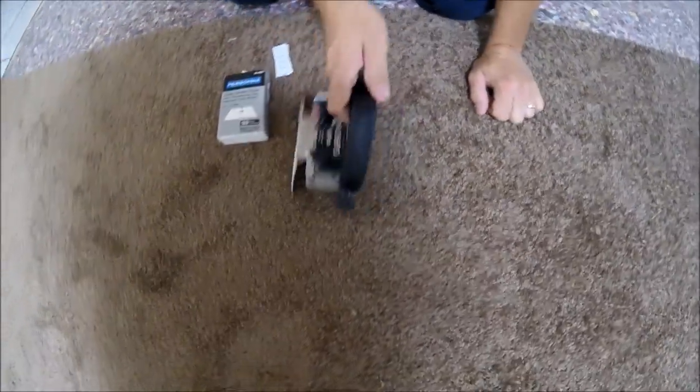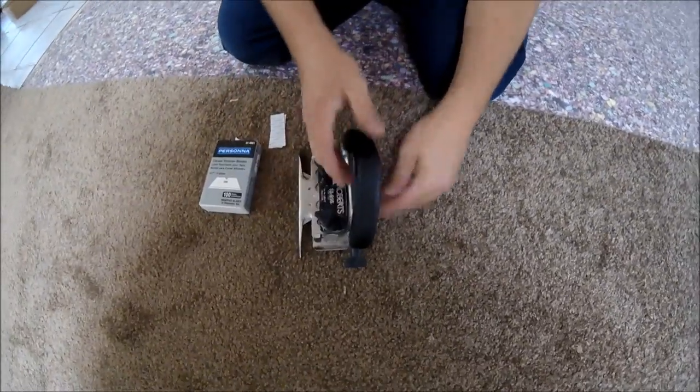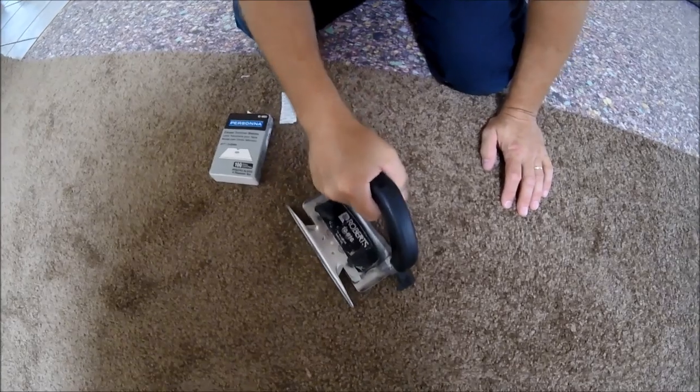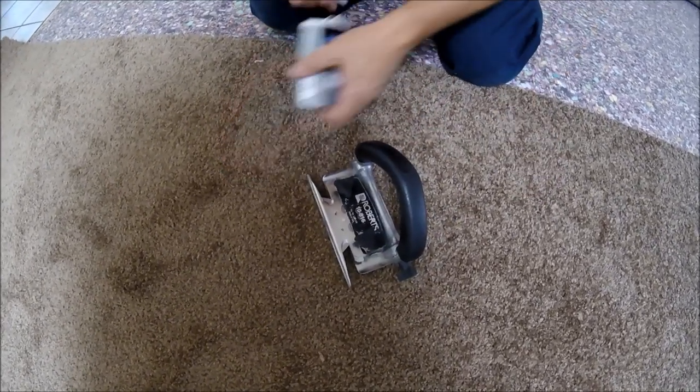My handle here — I just got it at a slight angle. It's not straight up and down, it's not laying down too much. It's just where it feels comfortable for my hand there. And that's how you change the blades. We got just a little piece of carpet here up against the wall to demonstrate, because I want to cut it long, I want to cut it short, and I want to cut it right. I want to show you all three different directions — three different aspects of how you would cut it short, cut it too long, and then the proper way to cut it right.